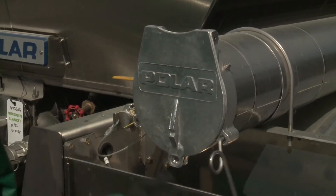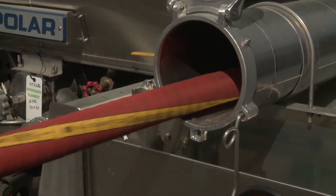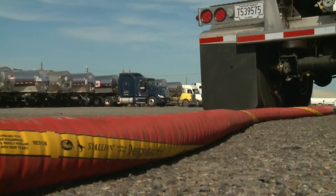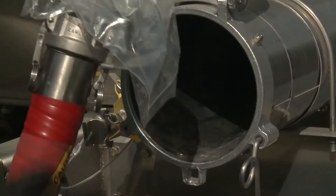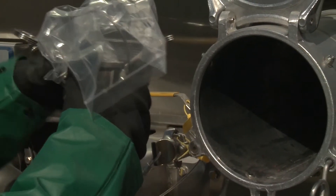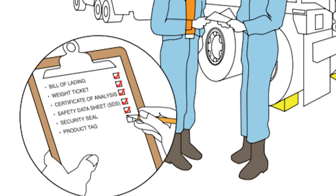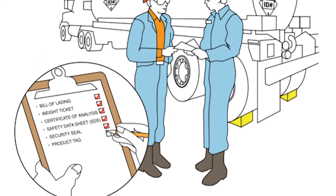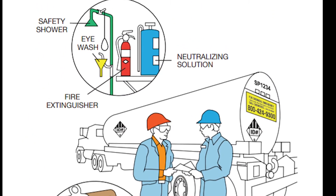Transfer hoses for TDI products are typically two inches in diameter to differentiate them from the three-inch diameter hoses and fittings generally used for polyol or resin products. Hoses may also be color-coded and/or labeled to assist in eliminating transfer errors. Because TDI reacts with moisture, it's extremely important that hoses are dry. If there is any possibility of a problem with a hose, set the hose aside, tag it, and get another hose to complete the transfer. All these checks may seem unnecessary because the operation is routine, but taking these precautions every time will help prevent product contamination and a potential overflow.